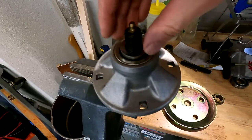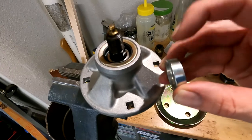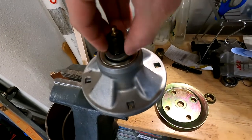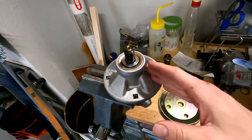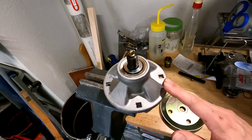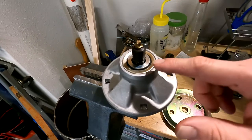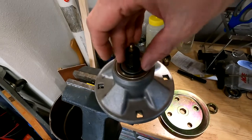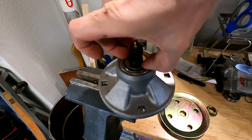The seal isn't going to do anything. Grease is going to come out of that right away. And there are sharp edges on this bushing, so if you push a seal in or pull a seal out, it's just going to get cut. So far, I'm not really impressed with this. Now, that isn't to say you couldn't tear this apart and put new Deere parts in it. If you had a really smashed up Deere spindle and got one of these for $40 or $50, maybe with better aftermarket seals or bearings, you might be okay using this as more of a core for a rebuild. But yeah, I am not impressed.